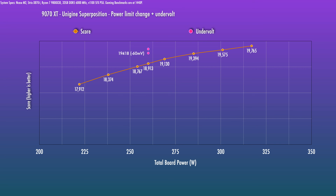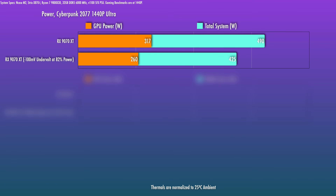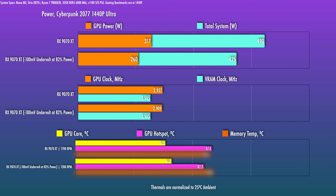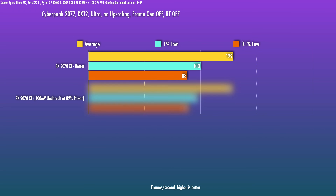I haven't had enough time to give it the full FurMark treatment, but your mileage may vary. At this point the score was 19,615 — basically full performance. I fired up Cyberpunk and the card was drawing about 425 watts at the wall; board power was just slightly under 260 watts. With the reduced power, we're running similar fan speeds to what the 9070 did during its gaming test. I'm confident I could do a little better with the full curve, but saving around 60 watts and getting equal performance — I think a lot of you would be pretty happy with that.